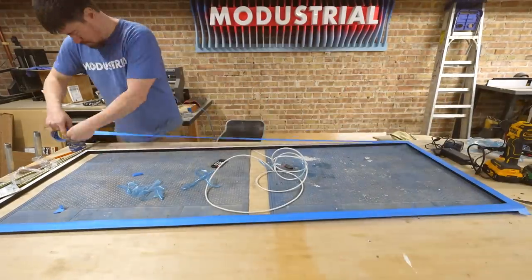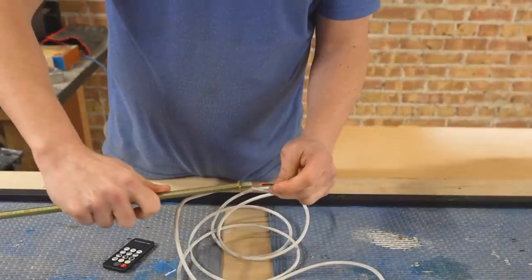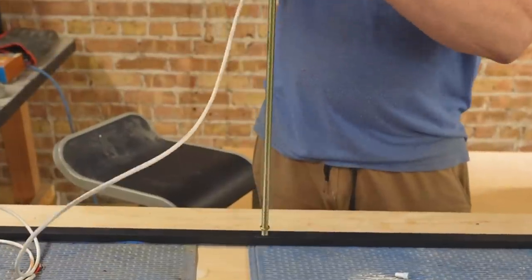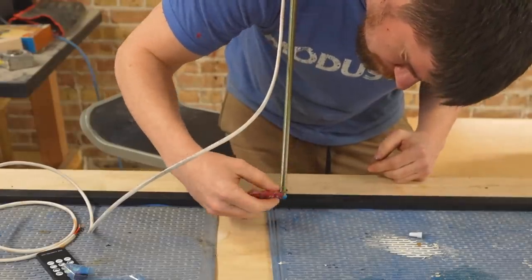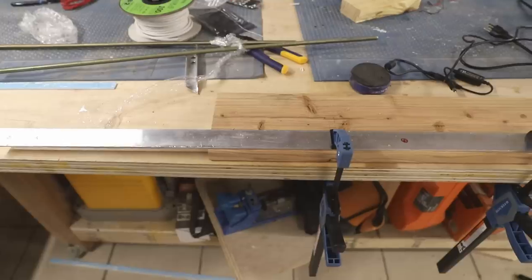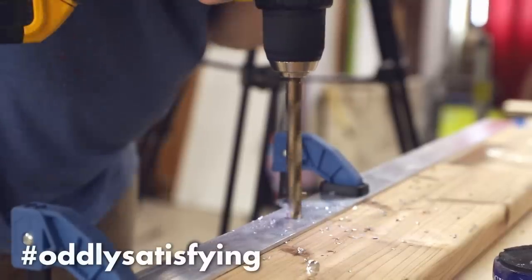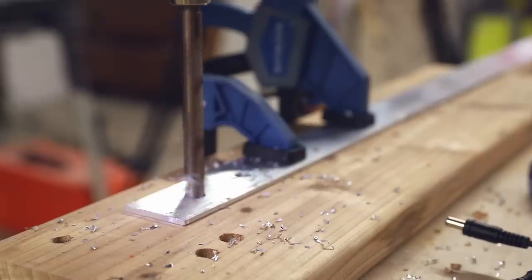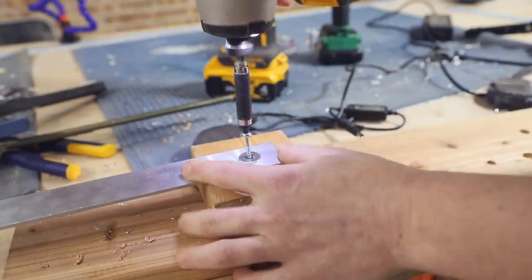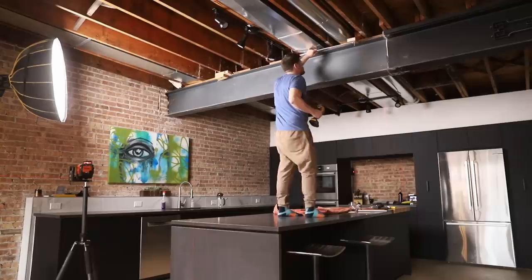Now it's time for the trick of threading the LED wire through the threaded lamp pipe — this is really what makes it all come together, allowing the fixture to float without wires getting in the way. I had to track down lamp pipe that was three feet long, which was kind of hard to find. I used a little thread locker on the nuts at the top to lock it in and make sure the threaded rod was secure. Then I used an aluminum flat bar to make the mounting plate, which I'll attach to the ceiling and connect the threaded rods to. I originally planned to screw it right into the joist, but had to lower the bar a bit to get around an HVAC duct — blocks of 2x4s blend in perfectly with my timber ceiling.